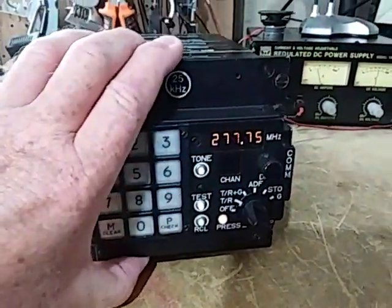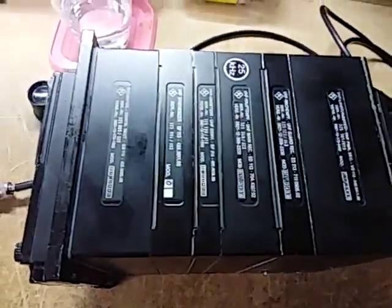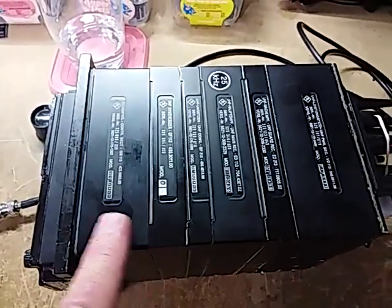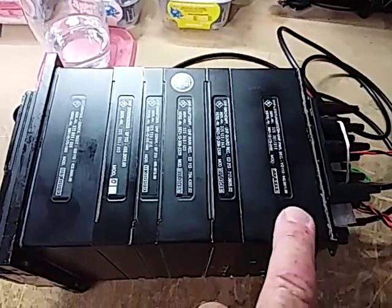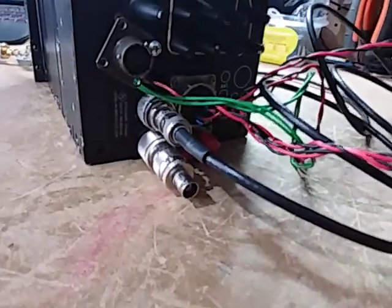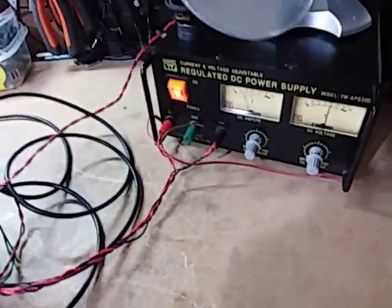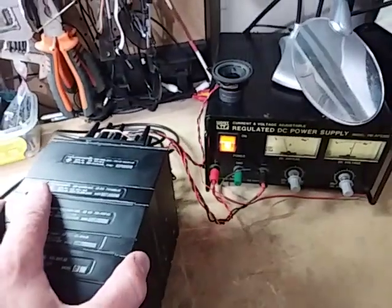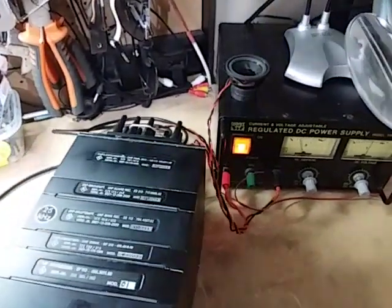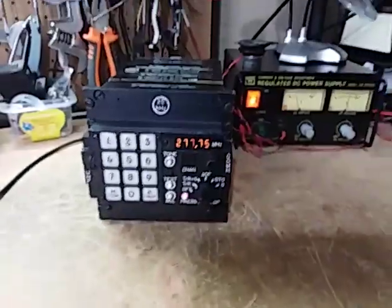We figured out how to get the transceiver going. It's all control unit synthesizer. There's a power amplifier that puts out about 10 watts. We figured out how to connect it all up — there are some dodgy connections here and it's powered off this power supply. We're running it through to a speaker over there. I haven't worked out how to adjust the volume; I'm not sure whether it can be. Maybe there's a DC control voltage that needs to go into it — we'll work that out a bit later.